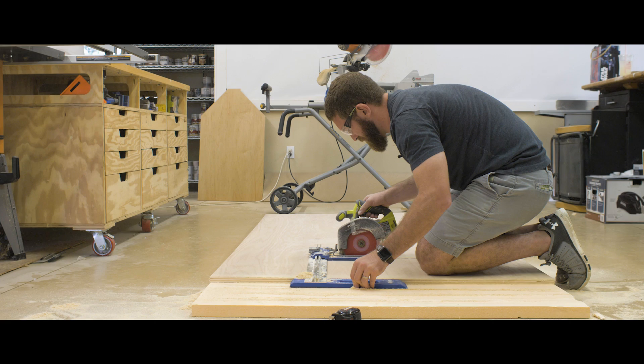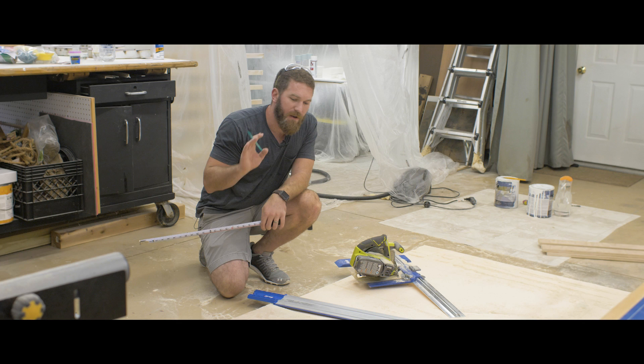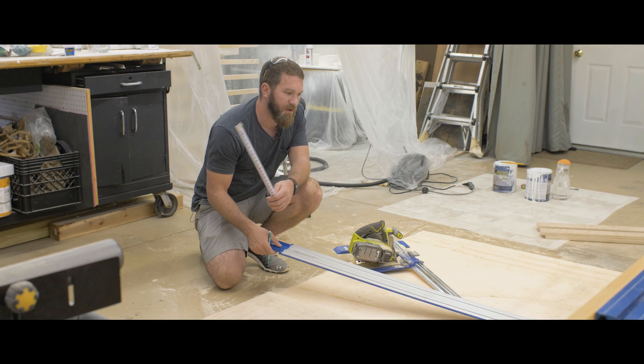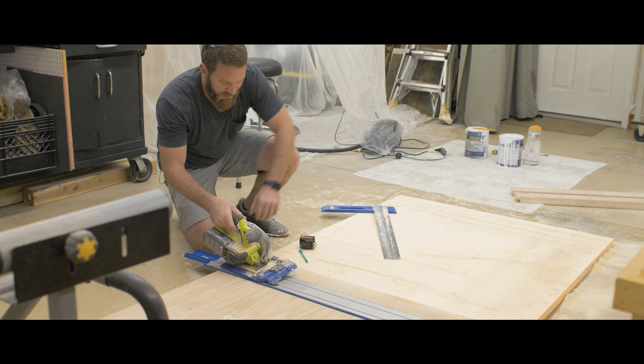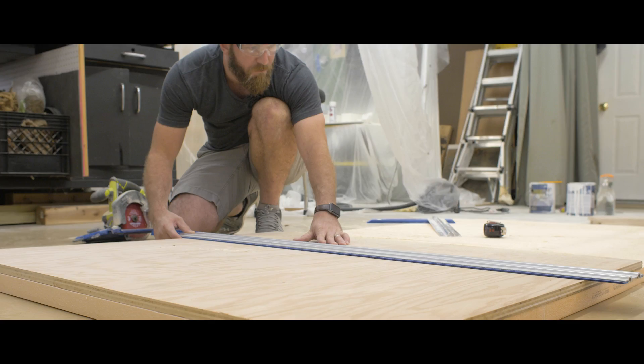I was able to break down one side of the plywood, but now I've got to make a 32 and a half inch cut, which is a little more than the rip cut's capacity of 24 inches. The cool thing about the new rip cut and the AccuCut is that they're interchangeable. So I'll mark two points, slip the rip cut off, and set it right on the AccuCut — it's essentially a track saw. I mark two lines, get a straight line, and cut right down.